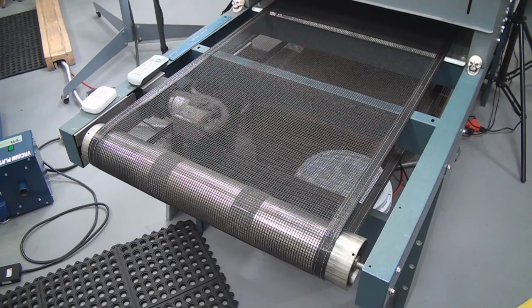You'll see the belt motor is here and the entrance portion is normally a little bit longer than the exit. There are no belt adjustments on this side, but you can see where the belt is tracking. It's tracking straight but a little bit off to the left, and that's okay — as long as it tracks straight you're good. Whether it's centered on the pulleys or not, you want it more or less in the center, but if it's off just a little bit, don't worry about it.